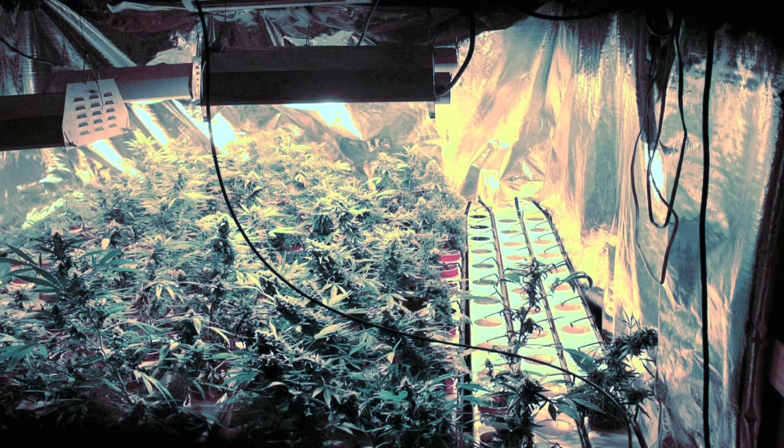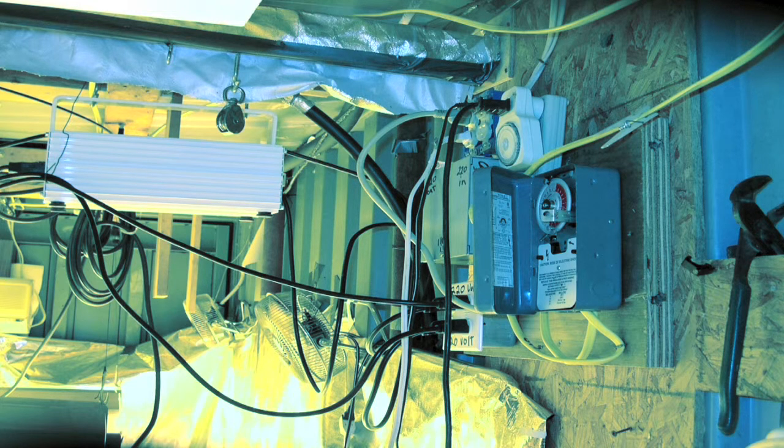You can see the quality of the marijuana under the lights in this photograph. In slide number 157, Level 2, Chamber 1, the water, electric, and timers. Now look at this closely. You see a ballast box hanging, you see wires routed everywhere, you see water pipes crossing over electrical wires. All of this non-standard and definitely not to code, and definitely a confined space and a danger to anybody going in it.